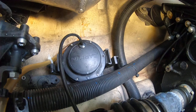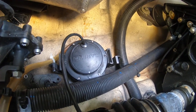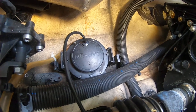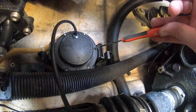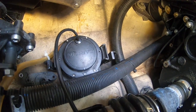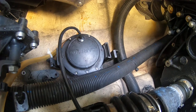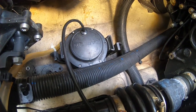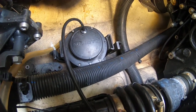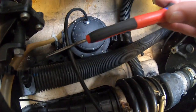What they do is go into the holes in the housing right down here. That affixes the cap more firmly to the housing itself. The holes are already pre-drilled in the cap, and the self-tapping feature allows the screws to penetrate down through the housing and make a secure fastening of the top to the transducer.